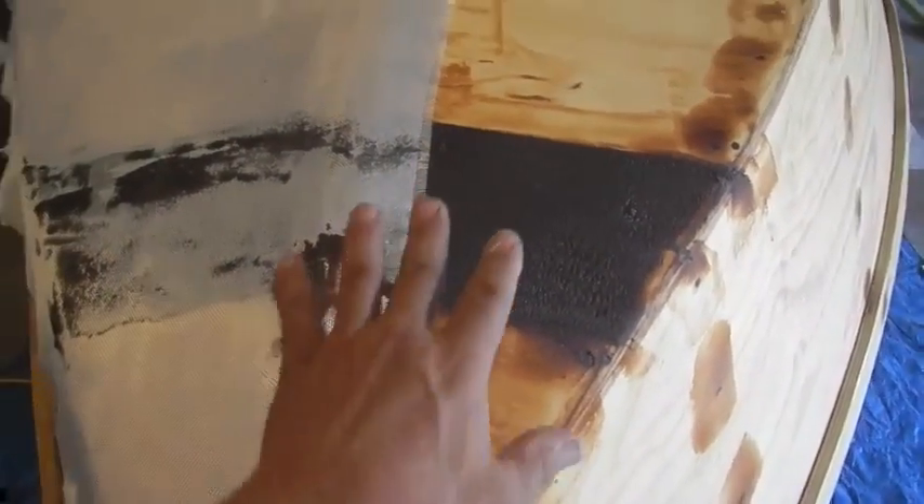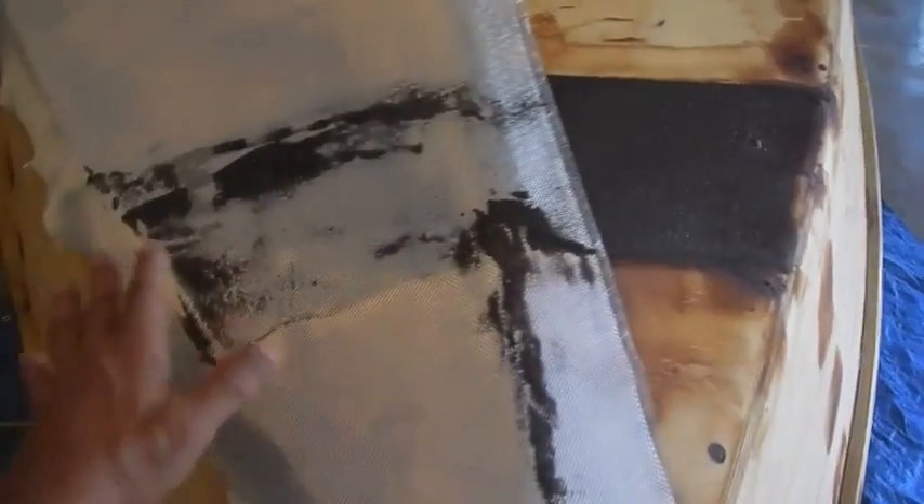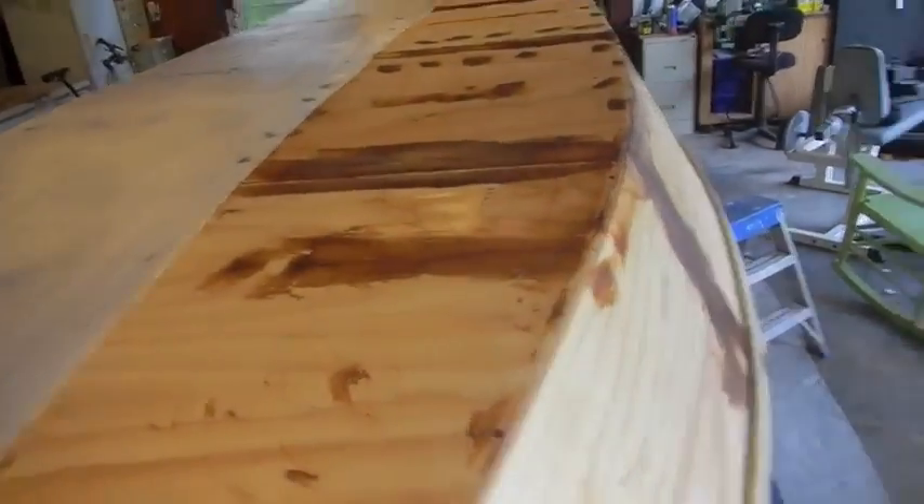Real quick because I've got some epoxy wet. Remember how that was pieces? It's still wet - see, I put the glass. I just faired it out with wood flour, kind of to the shape, filled in all the nail holes, filled in the seams. And as I said, I like wet on wet so I'm just going on.